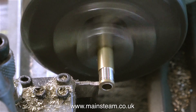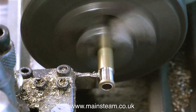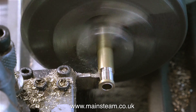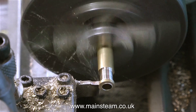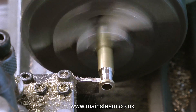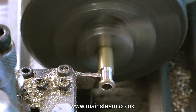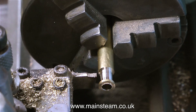I'm using a small parting tool to cut the middle out of this piece of brass. Maybe it's not the right tool to use, but it does the job very quickly and without any event. It's squeaking a bit and protesting, but it's cutting the brass and that's all I want it to do. Don't forget this is not a high precision item — I'm going to be cleaning it up with some sandpaper in an attempt to make it look like a casting anyway. I like making things like this, provided there's only two. I don't like mass production.